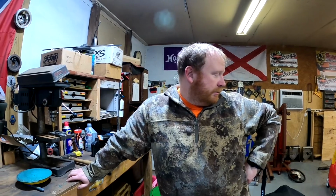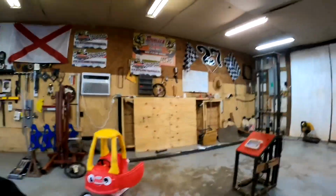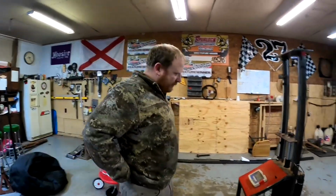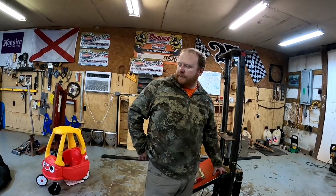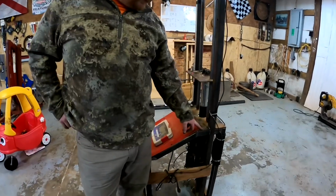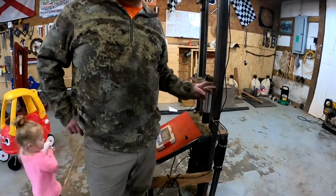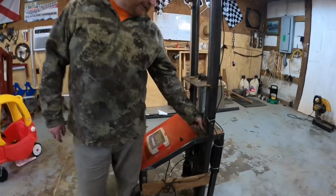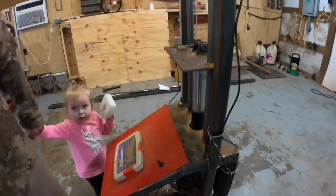What do you think? So is this all of the base? That is the base and the main 2 upright tubes. Still gotta cut the uprights there where the screen and all that go. So what he's talking about here is that base down there and then those. That's what all that is. Well, it's gonna be fun tomorrow, I gotta notch them plates. See, this one right here's only got 1 plate. So I've got to notch 3 plates right there to go around this 1.5-inch square tube in there.